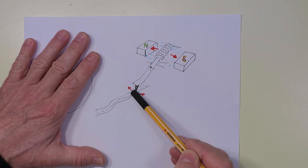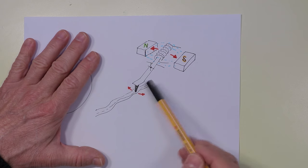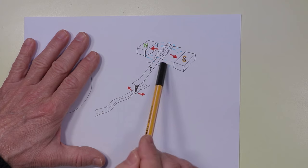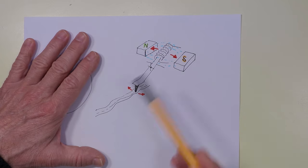Imagine it like a microscopic canyon. Unwinding the groove from the spiral, it can be seen as a linear motion like unwinding tape from its roll. A stylus with a needle tip that travels inside the groove follows its meanders, which in turn move the stylus that pivots at the center and moves a coil immersed in a magnetic field, generating a current proportional to the deviation, which is amplified and sent to a loudspeaker to reproduce the music.